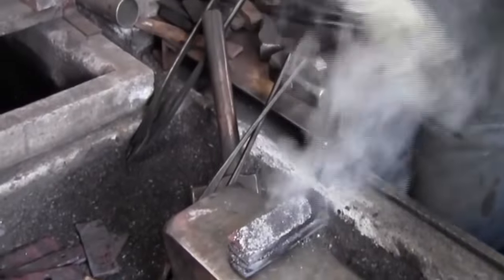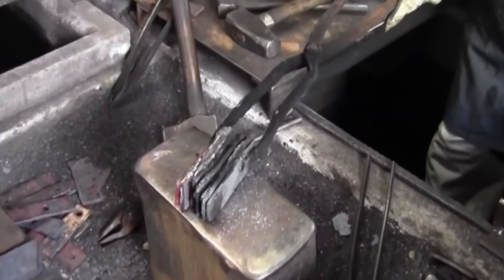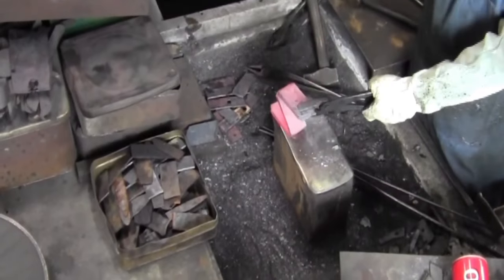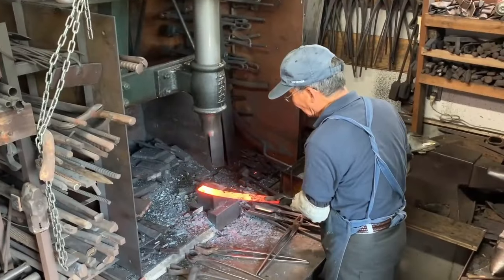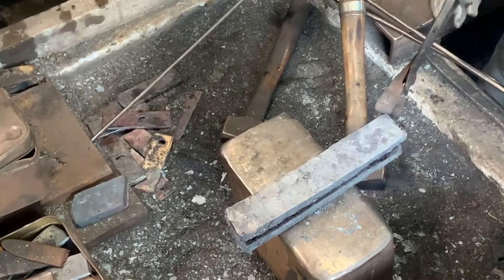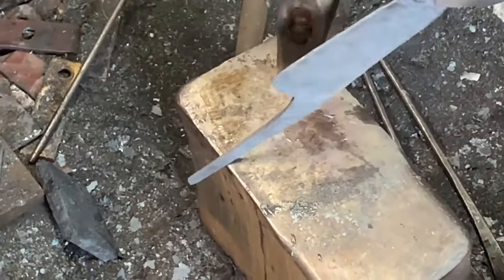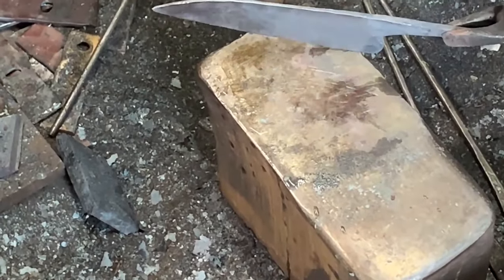Kageura-san uses a variety of materials for his Damascus cladding. He cuts and hammers pieces of steel from at least two sources into uniform sizes. These pieces are stacked, alternating by source material, and welded together. With flux, heat, and hard hammering, he forge welds these stacks into one piece. This piece is drawn out, folded, and welded multiple times, creating a bar of 63 layers of steel. This process, taking about 3 hours, produces enough steel for just 5 to 8 knives.